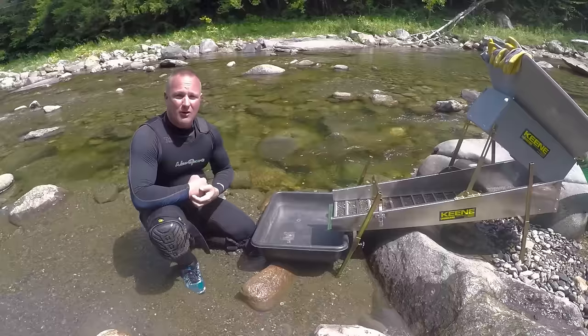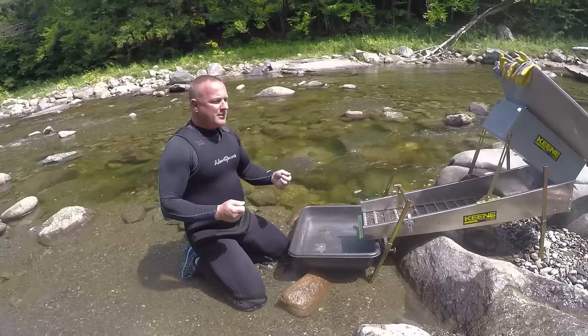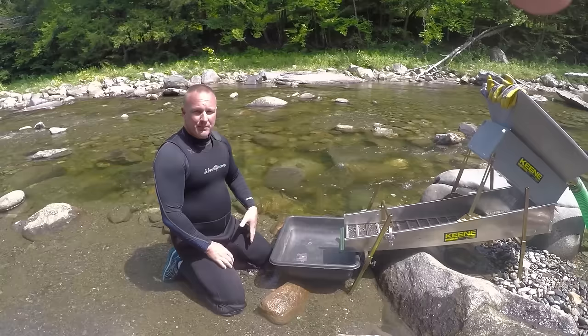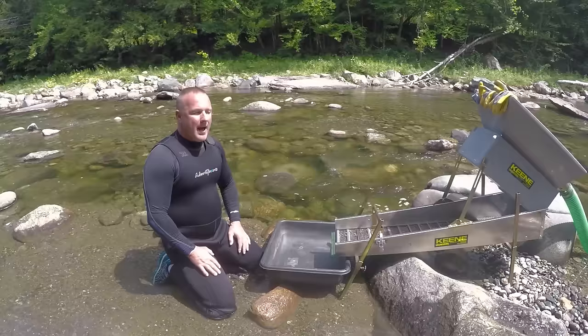But when we're doing it, the green mat and the miner's moss, we like to take it and stretch it and slap it into the water so we get every ounce of material that might be embedded down into there. And the green carpet, we smash it into the water as much as we can. At the end of every year, we'll burn that green carpet on something tin and pan out those ashes, because there's always a little bit of gold impregnated into this green matting. And we get to start the year with some fresh green matting on top of it.